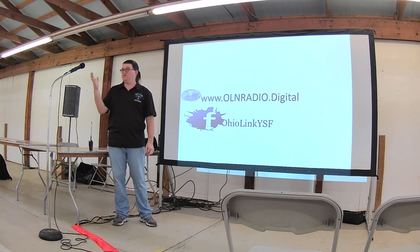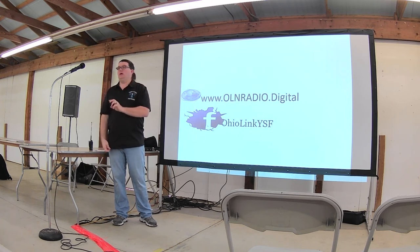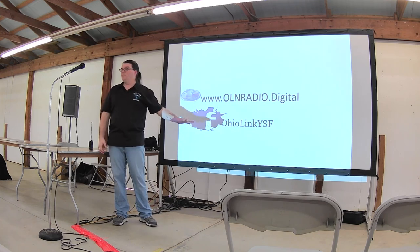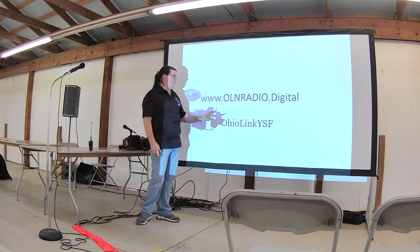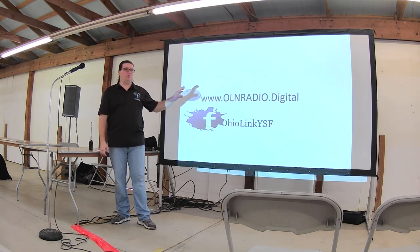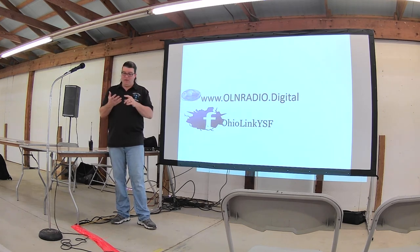The reason why I pick on AmericanLink is because they are so busy. The only way you can change in and out of the rooms is if there's no traffic. You change it over to a room, you can talk, but there has to be at least 2 or 3 minutes of no traffic for you to physically take that repeater out and put it back. Now, the 15 minute mark is if there's 15 minutes of no activity, they have what's called a return to room, and that's based on Wires-X. Let me go back to the thing. The ones that say locked are pretty much proprietary, owned by OhioLink. But there's a lot of repeaters that are collaboration. One of our biggest growing attributes is we keep communicating, such as Findlay.